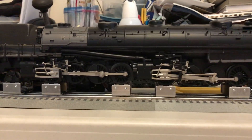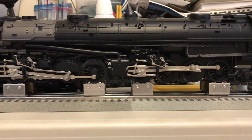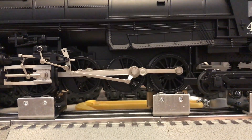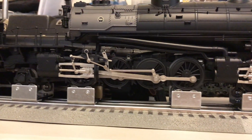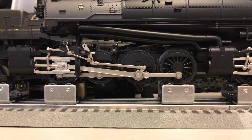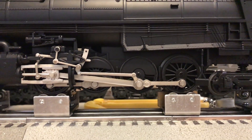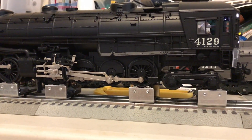The rear right set of rods is put back together after a little bit of trial and error. You can see the rear set of rods — this is the correct positioning for the valve gear and the eccentric crank versus the original as-delivered positioning. There is a noticeable difference. Stopping it in the rods-down position on the rear: that's your corrected locomotive truck, and this is the as-delivered rods-down — as you can see, there is a clear difference.